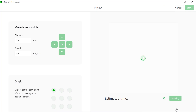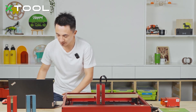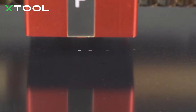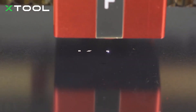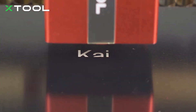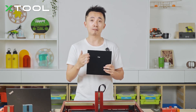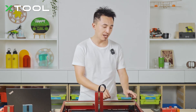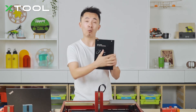Everything is ready — let's start the process. I'm framing it now. Once framing is complete, hit start. You can observe the engraving process; if you see a bright spot and hear a 'zzzz' sound, the focus is successfully set. The infrared laser is perfect for engraving all metals. If you engrave on black stainless steel, the pattern color will be white, but on silver stainless steel the pattern color could be different — possibly black — so just do some tests. The infrared laser module is also perfect for engraving on plastics such as acrylic, where you can create a white inner pattern like this.